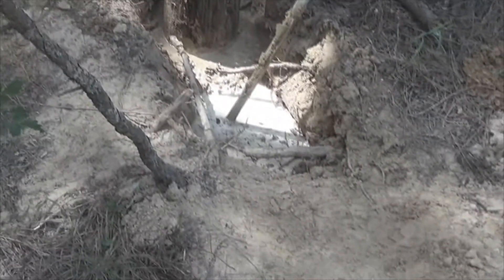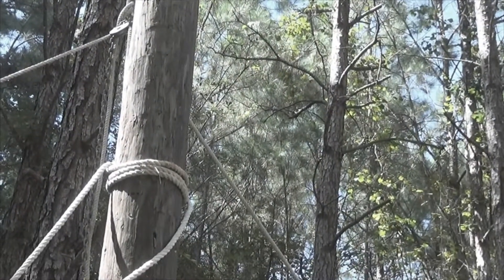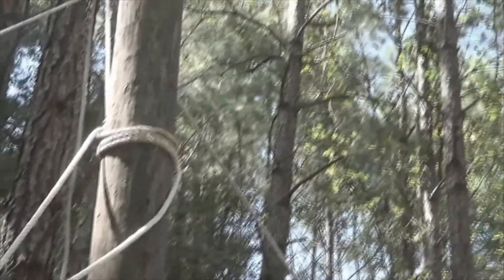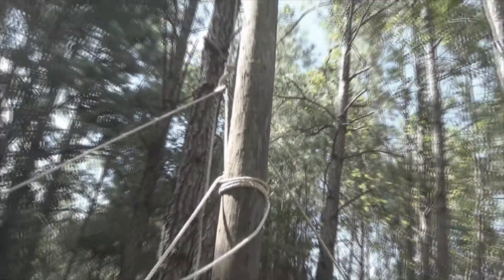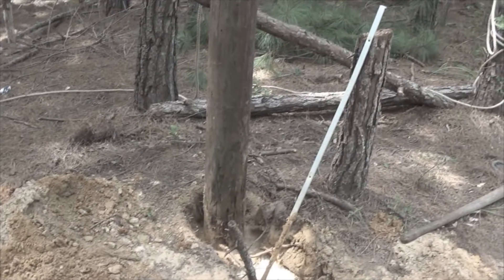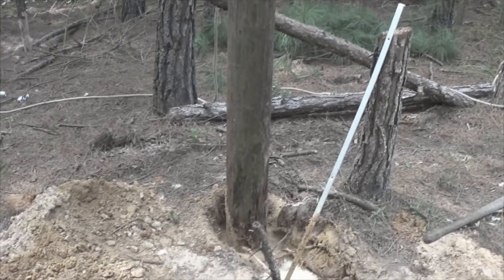So what I did was I had my pole, I had the butt of the pole down here and the length of it coming back this way, and then I started my lift using the snatch block assembly that you see up here. I also used the Kubota tractor to help pick up on it, just to make the lifting process a little bit faster. But as far as the Kubota goes, I could only use it a very short amount, and after that I didn't have a way to keep the pole on the Kubota. Once I got it into position like this, it still wasn't quite right, so I wrapped a rope around it and a stick, and I twisted it, and it fell right into place, and life was beautiful.